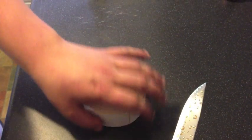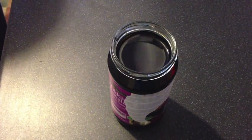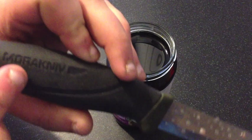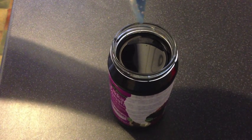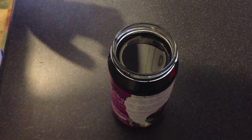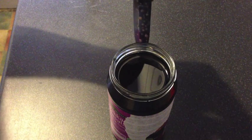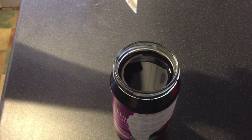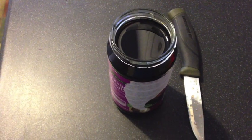So now the next part is the dipping. Here's the acid — I'll put the link in the description for where you can get it and also the name of it. The handle is plastic so the material won't actually be eaten by this acid because it only affects metal. Basically what you'll do is dip this into the acid and leave it hanging. I normally leave it for about 30 minutes. When the acid is a little bit older you'll obviously need to leave it a little bit longer to make sure you get a nice etch.